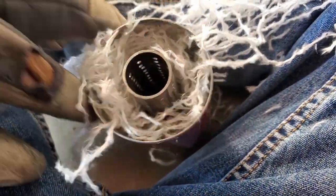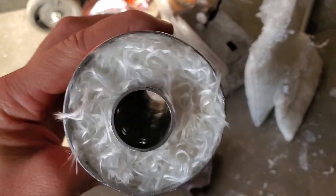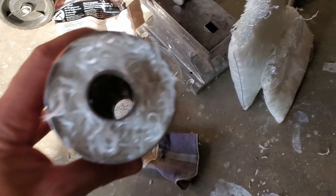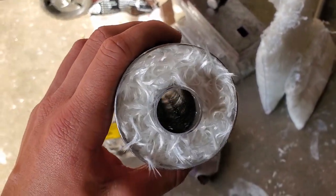First try — this stuff's a little bit too thick to fit into my silencer. So I'm just going to pull it out of the encasing they have it in, take the individual fibers and grains and stuff them in the pipe by hand. It'll work just fine. There's what she looks like all packed up. Like I said, it wasn't working all together, but it worked just fine. It's very tight. I'll put the cap on it and weld her up.